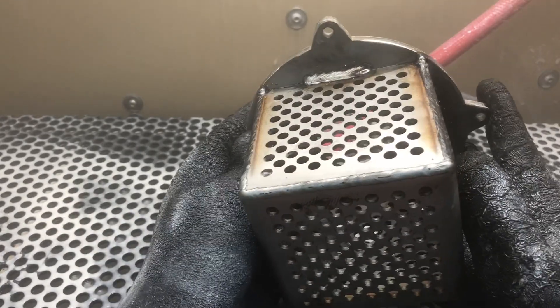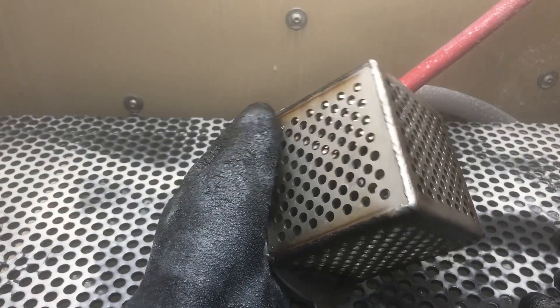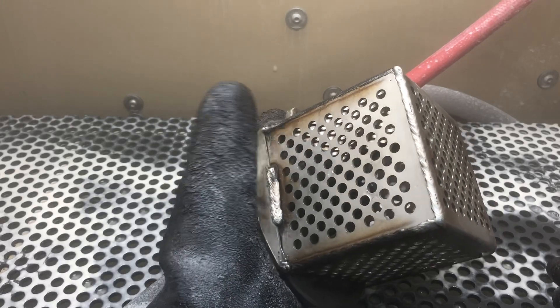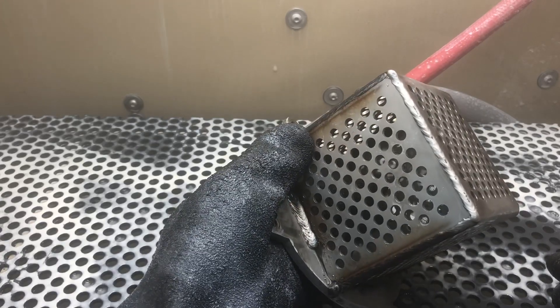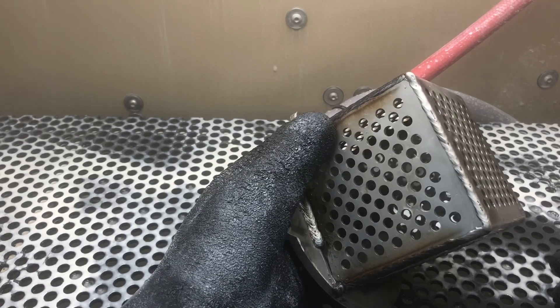This was fast and easy — 15 seconds. A dry process is going to be dusty and messy, and you have to make sure the part is clean and dry before it enters the cabinet. With the vapor honing system, that's not the case, so it's going to save you a ton of time. Also, the abrasive is going to last eight to ten times longer, as with every other consumable in the cabinet. If you have questions, give the sales team a call or shoot them an email — they're always here and happy to help. Thanks for watching.